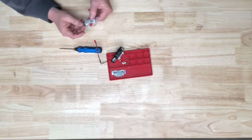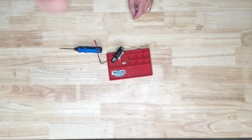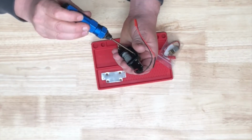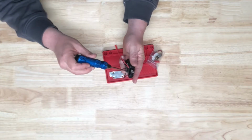Let's get at it. All right, guys, so there's the little motor. Again, I'll put a link in the description for that. You basically just have to take out four screws here, here, here, and here with the 1.5 millimeter hex.